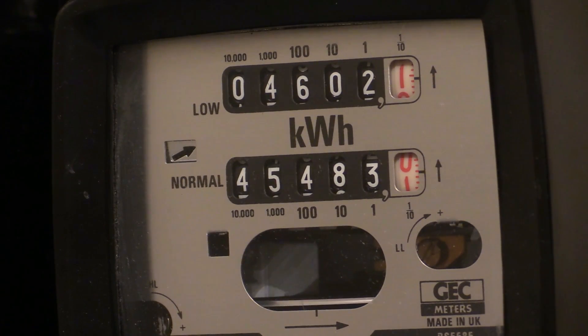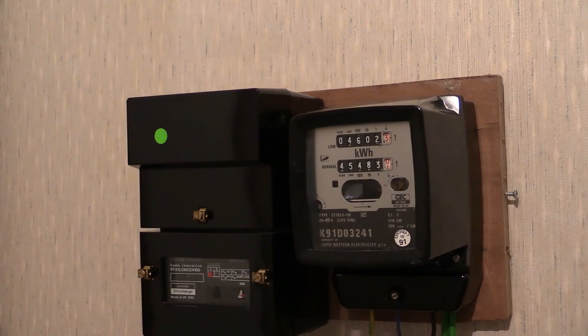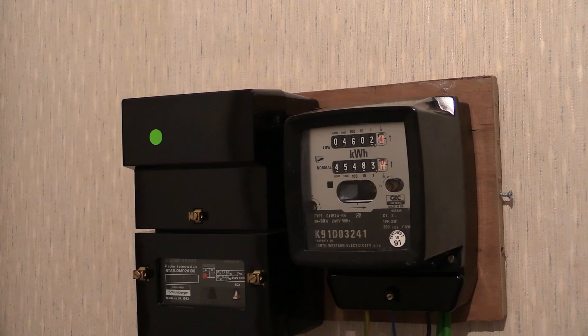I've got to wrap this one up because I've got to put it back away, de-energize that electric meter. I'm going to keep the radio tele-switch energized throughout the night and around about 9 o'clock tomorrow morning I'm going to unplug it - that'll be the last time I'll energize it up. A bit later on in other videos, what I'd like to do is get this up on the wall again, but instead of a radio tele-switch, I'd like to replace it with what went before it - namely a 24-hour rate-changer time switch. With that I'll be able to set the control when I want it to turn on, and I could even do it during the middle of the day. With a radio tele-switch, I have no control over when it turns on and off, which is why I have to do this in real time.